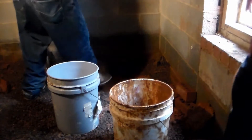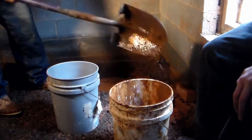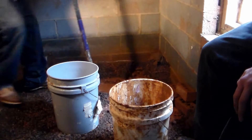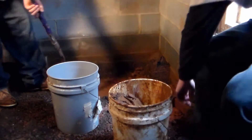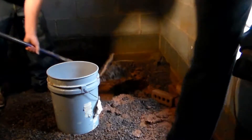We're going to start with the big shovel here. We actually have a lot of headroom, so we'll probably be able to use that larger shovel the whole time. We want to get the soil out of here — you can see we're putting it in buckets. One guy's putting it in the bucket, the other guy takes it out. We're just going to grade it out alongside the house. We've pulled back the pine straw and we'll just set it out there, grade it out, cover it up with pine straw — all good.